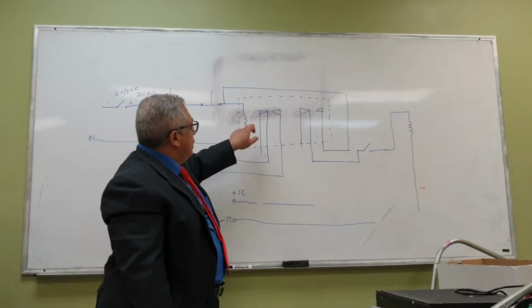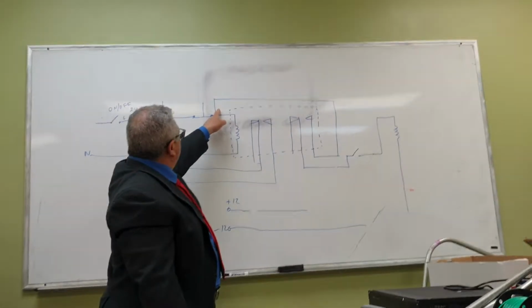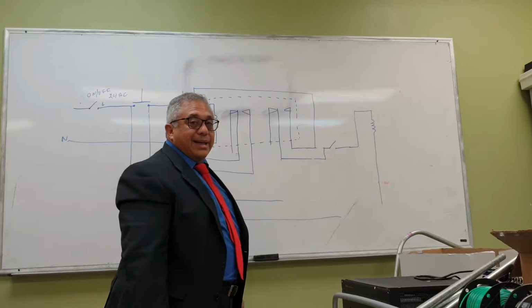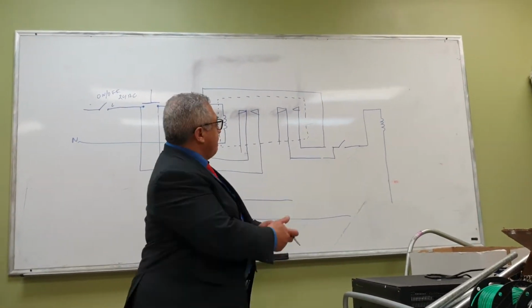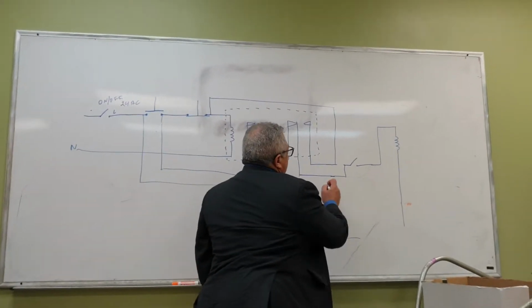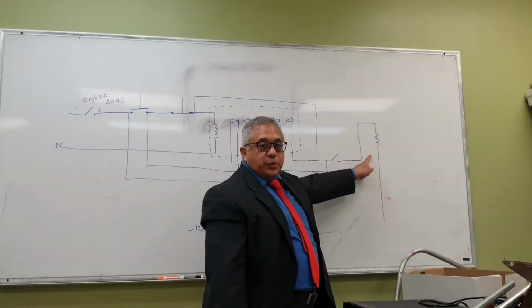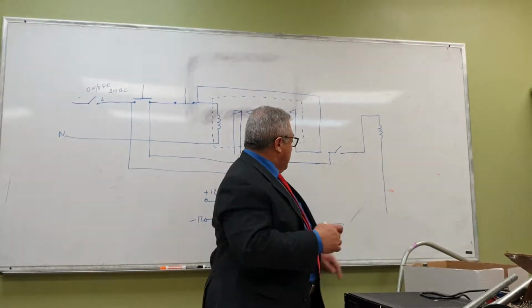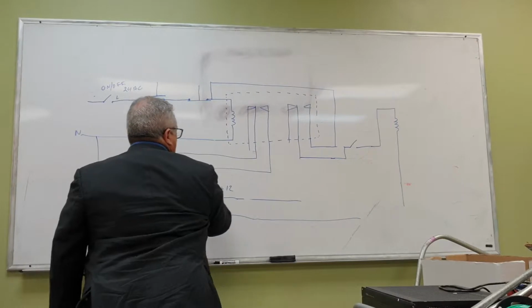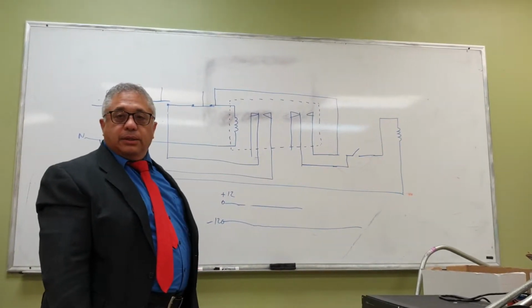Do you follow me? Look. You press the button, relay gets activated. This thing connects with this. The power here, 24 volts AC, goes through the contact and now turns on the motor. Okay? When I want to stop the motor, I press here, I close the power for the whole thing, and it stops. So, when this is activated, it gives me power here, that gives me power to turn on and off this relay with AC voltage, okay? Therefore, this part of the power supply needs to be connected to neutral, to the neutral of the original AC.